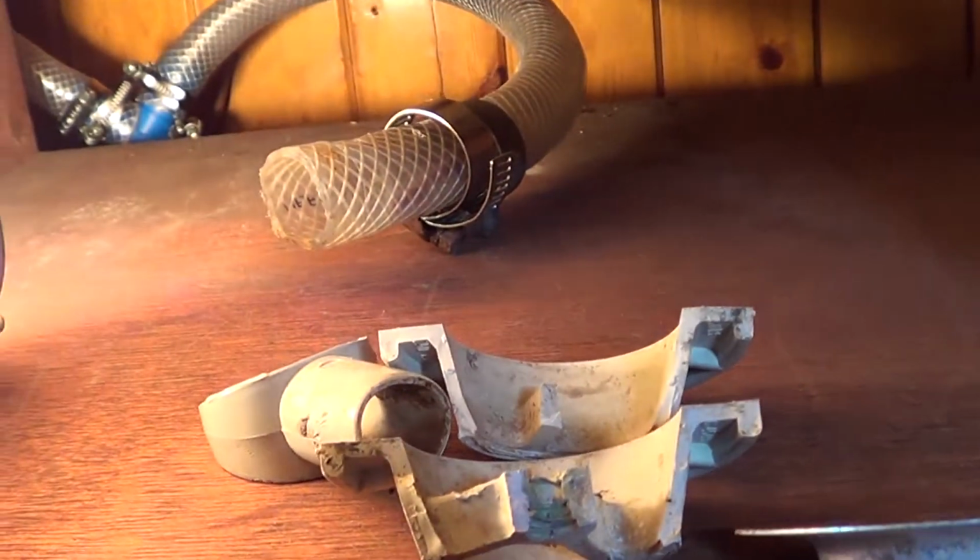One thing I do think quite strongly, coming back down here, I know a plumber told me this many years ago when this came into being. When you are cutting this plastic pipe, this is the John Guest, you do really need to invest in the cutter. It's critical, apparently, he always told me, to get the cuts as square as you can.